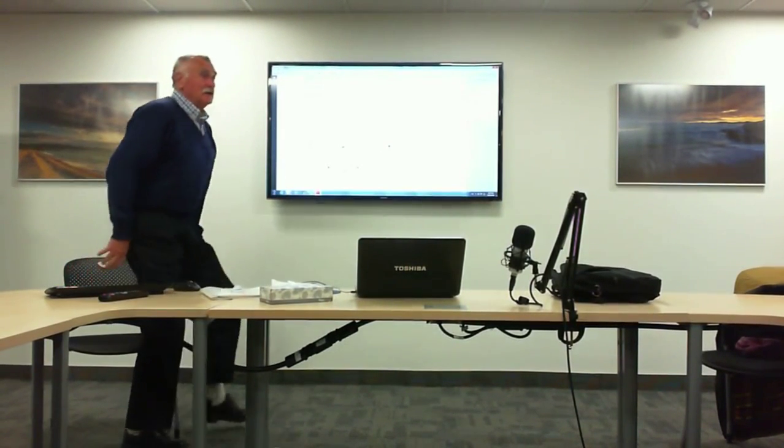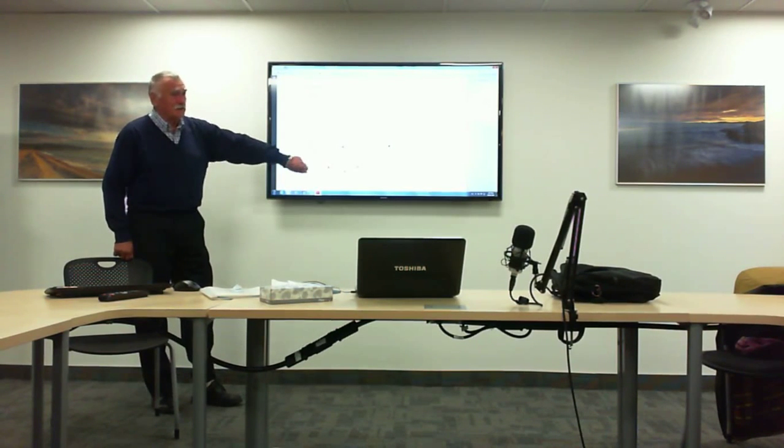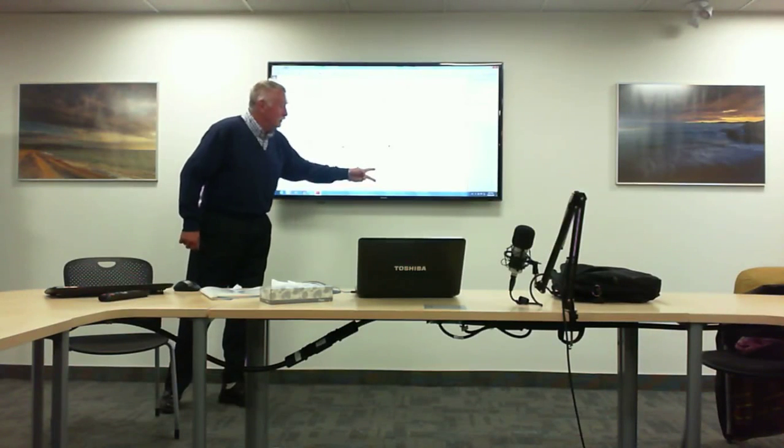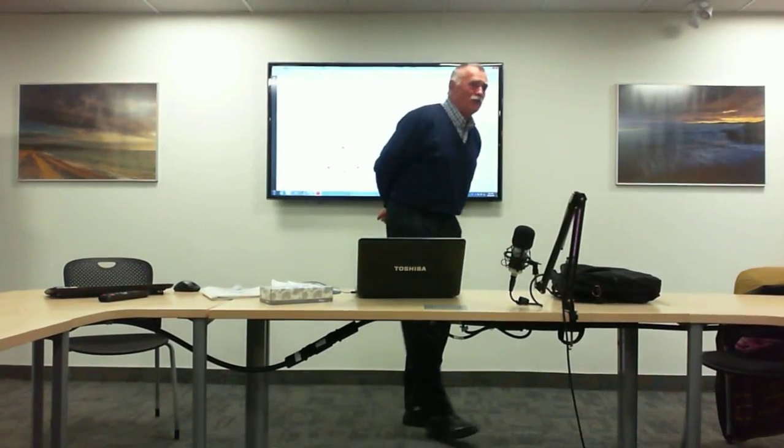Then the next possible radio would be called a tuned RF receiver. For a tuned RF receiver, we return to this schematic and we attach an amplifier to it. The RF part is a variable capacitor, 500 picofarad variable capacitor. You tune that and you attach an audio frequency amplifier with a single stage or two stages. In the old times, there was a one tube or a dual tube amplifier. Nowadays, you probably use one of your surplus computer speaker amplifiers as they are.